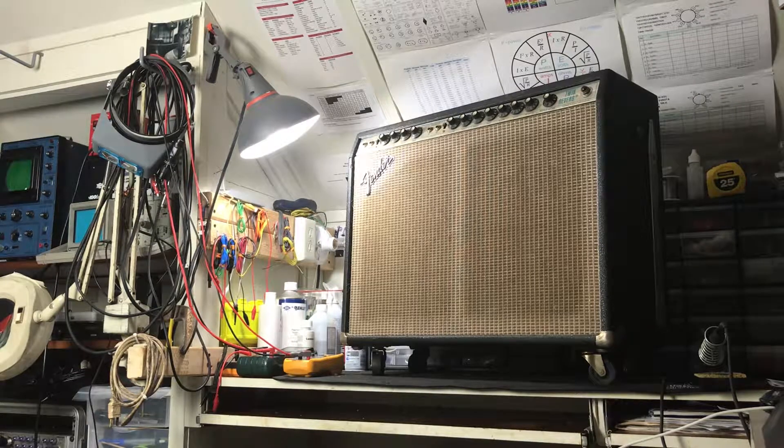What's going on YouTube? This is a rather lengthy four-part series in which we will attempt to repair, overhaul, and modify this 1974 Fender Silver Face Twin Reverb. In the first video I attempted to explain how tubes work. We repaired the bias circuit, encountered a low volume issue, replaced the power cord, and overhauled the amp by replacing the electrolytic and filter capacitors. In this video I will attempt to explain how to measure and modify the bias in cathode and grid bias amps, and we will also modify the Silver Face circuitry to allow the bias to be changed more easily by adding a bias pot.